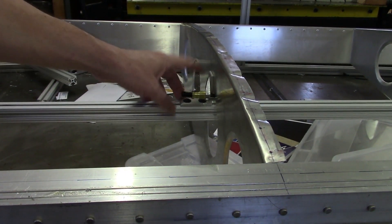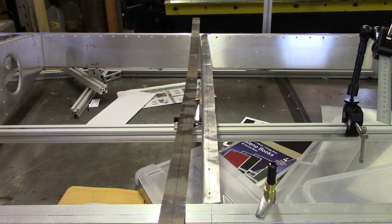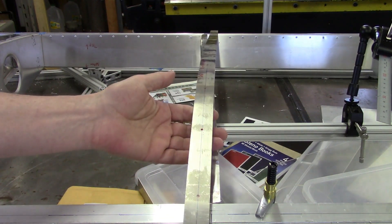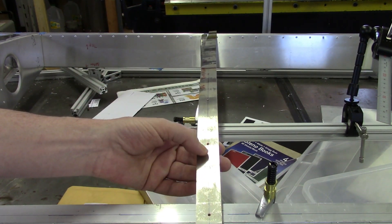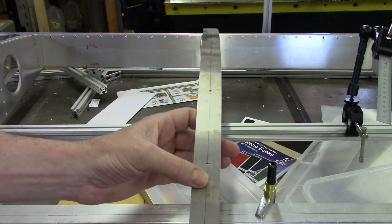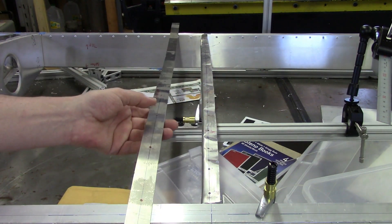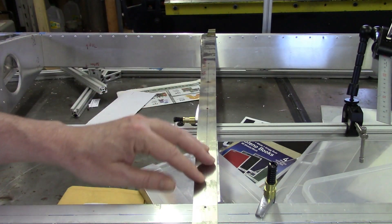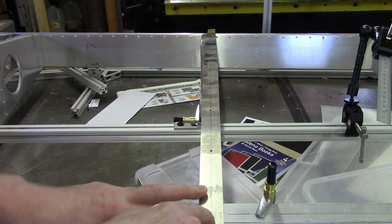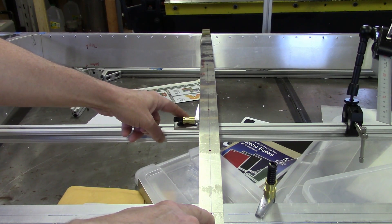On this side here, of course, you've got screws. I could loosen these up and be able to adjust this rib from side to side. I'll go into a few more details real quick as far as how I did the alignment. One of the things I did is I created an alignment strip — essentially a strip of aluminum, about four feet long and an inch wide, with a straight line drawn on it. On that straight line, I punched a series of holes and used those as my alignment points. I would essentially adjust the ribs so that when I've got this clamped over it and the hole lined up on the center line and on the rear channel, I can loosen the screws and adjust from side to side.